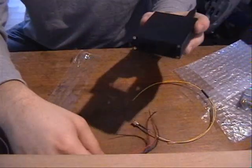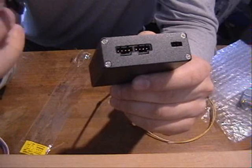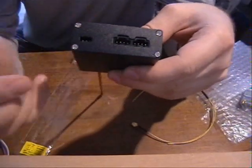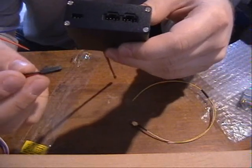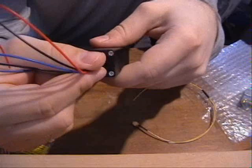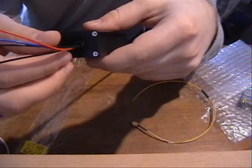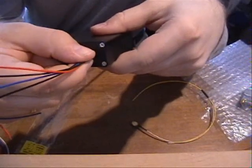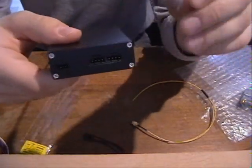To make it clear: here you can see the sockets. The first socket to your right is the one to supply the transmitter module with the PPM signal and the battery power. It connects like this — click — and it's plugged in. You cannot pull it off without pressing the small plastic button; it's secured. Not much strength is needed to put it in or take it out. Everything fits very firmly — it's just fine.